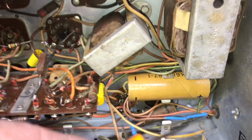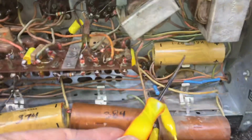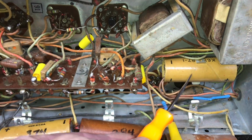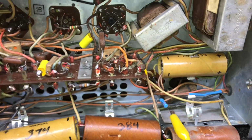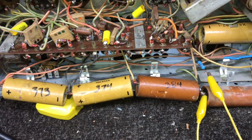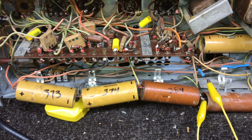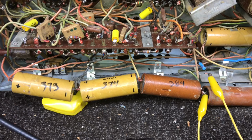And did have to add on a little bit of wire there to make it all work, and I took some acetone and wiped off the Sharpie 373, I think it was, that was on this one. Wiped it off. So 1, 2, 3, 4, and 1 on top. 5 to go. Unless we find another one that I've missed. But 5 more electrolytics in cans. Time to take a break.